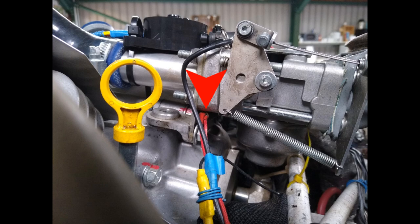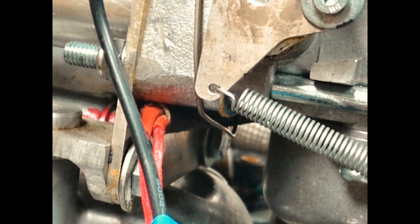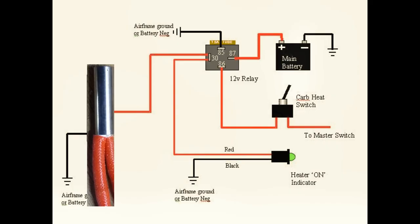I put the heating element inside a 6mm internal diameter bronze tube, which runs the width of the carb under the point where the butterflies are going to be. The tube is held in place by locking wire and the heater by exhaust repair putty and wire. I've used one for the majority of the installation. I did try two, but one of them went U/S very quickly, and perhaps the tube gets too hot for both of them. I'm not really sure, but I'm running with one at the moment.